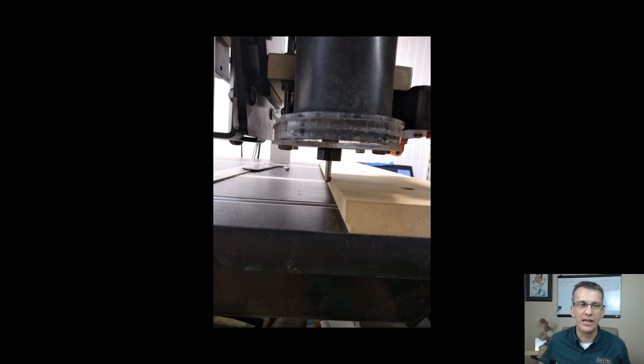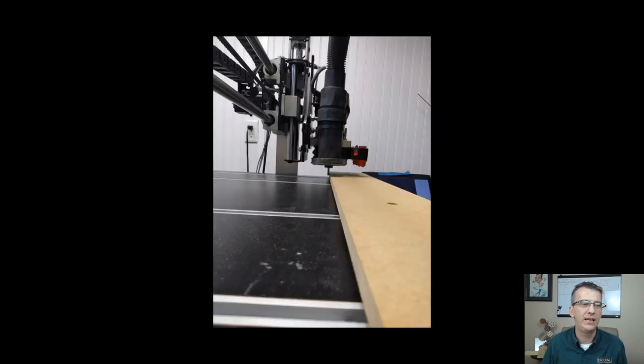I have a quarter inch alignment pin that I chucked up into the router, and I went to the far X positive side of the machine where it's sitting in this photo, and I basically brought the pin up to the edge of that part, and I was able to secure one of the screws, creating like a pivot point. From there, I took the CNC and I moved the Y axis to the negative side.